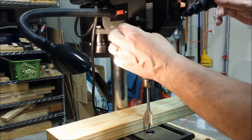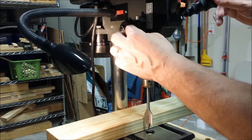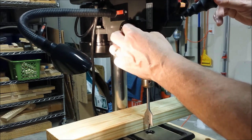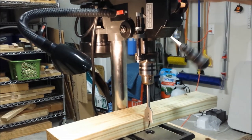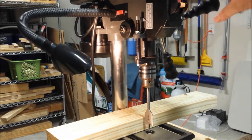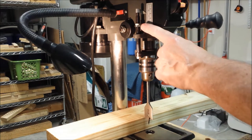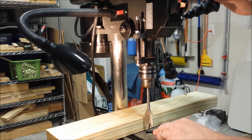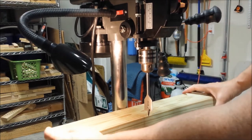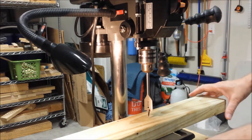I'll bring both of them down. Using both nuts is important when you're doing a lot of additional holes — not just one or two — because it keeps them from moving due to vibration. So now when I bring it down, it's going to stop right there. You can see these nuts stopping it from going any further. So in the case of the piece of wood I showed you earlier, the tip is going to punch through. When I'm done, all I have to do is flip my piece over, bring it down to the same point and drill through. Then I don't have that tear-out on the other side.